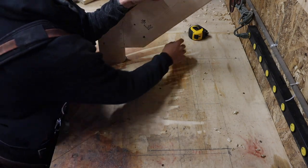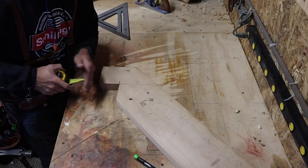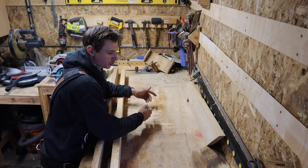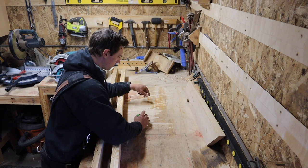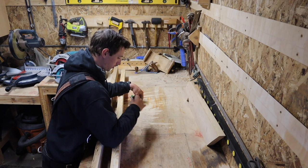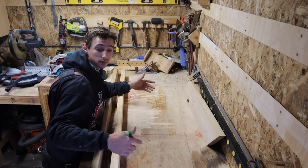That's your rafter. Now I can figure out this wall height — that's 3 and a half. So I'm going to start framing the wall, I'll probably time-lapse a lot of this. I need 2 plates at 7 foot. My new rise is 1 foot 9 and 5 sixteenths. I also have to add 3 and a half for that wall, plus another 3 inches. So this becomes 2 foot 5 sixteenths, and 2 foot 3 and 13 sixteenths is this wall height. Minus 3, so that's 2 foot 13 sixteenths. That's what I need 2 boards at, and then we can finish framing this wall.